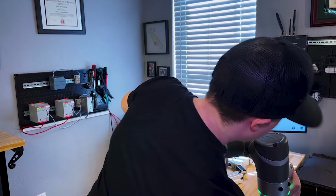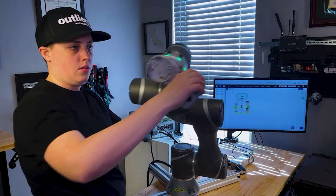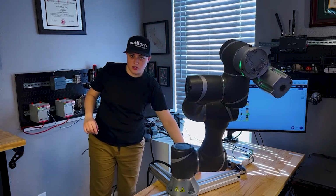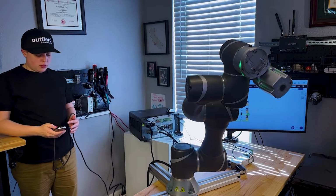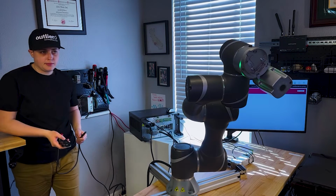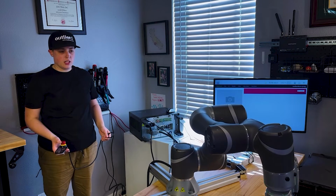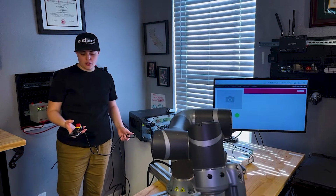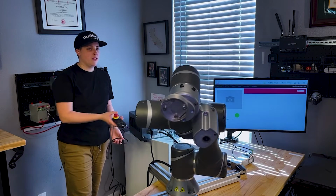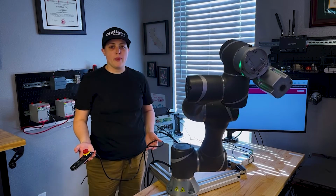So I'm going to do one here, one here, here. Okay, I got 3 points. I'm going to step back and be safe, and then push play, and we should get it to run through this immediately. Now this is a very slow speed, obviously. When you do this the first time, you want to have your finger on the e-stop. But what I'm really showing here is that with very little knowledge, you can just immediately start interacting with an application and writing a robot program.